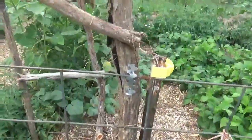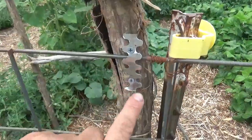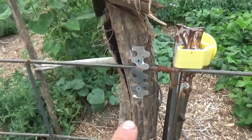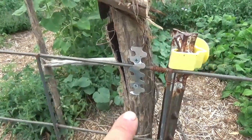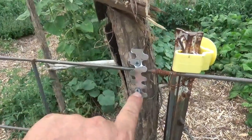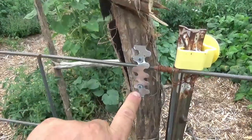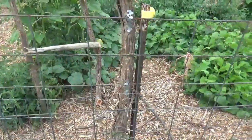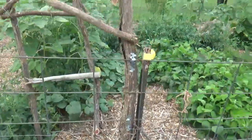It's brick ties. Just cut them into little pieces. They're galvanized. So I just drill a hole in there. I use a self-tapping screw, like a lath screw. It's a Phillips drive. I use that as a drill bit, and you can get a lot of holes out of one, so you're not ruining good drill bits. So I just zip it through there, take it out, and then put a regular screw in. This is an outdoor drywall screw, basically. It's a coated drywall screw. It's got coarse wood threads too. But basically, if you look for those, they look just like drywall screws. They're just a different color. Those are pretty affordable to use.